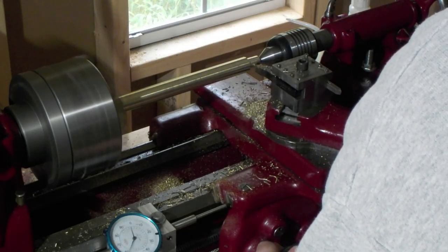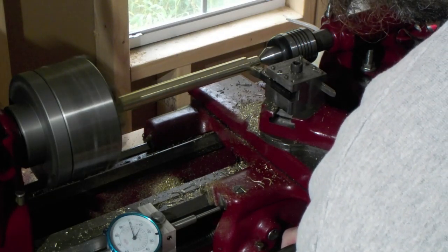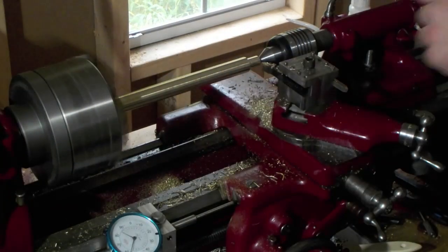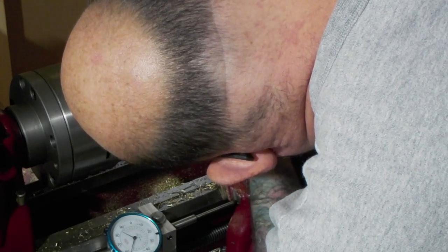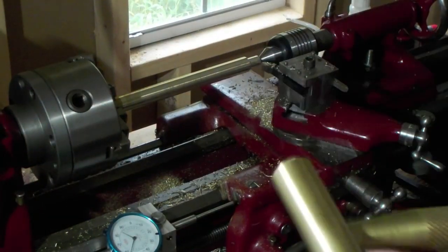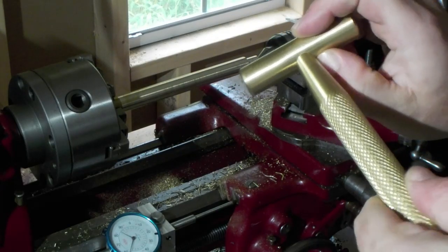Put on this stuff. It's like 499. We'll take it. This is what we're making. The reason we do that undersize, about 499, 498, is so it fits in that milled slot in the hammerhead.